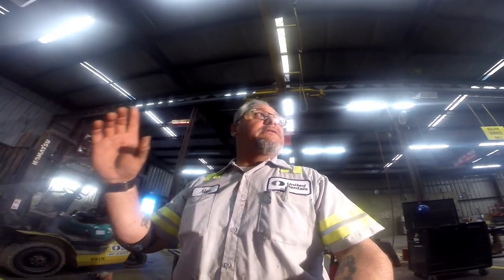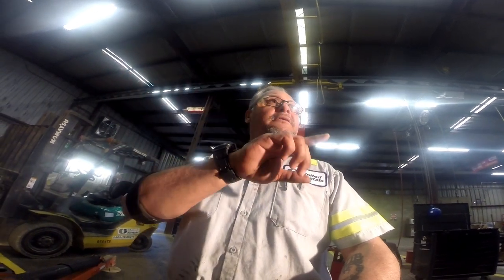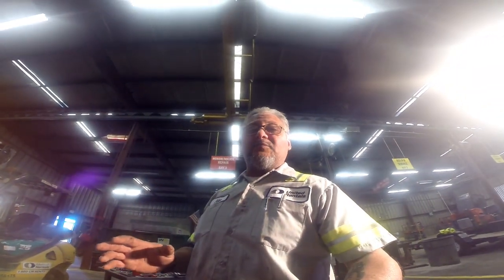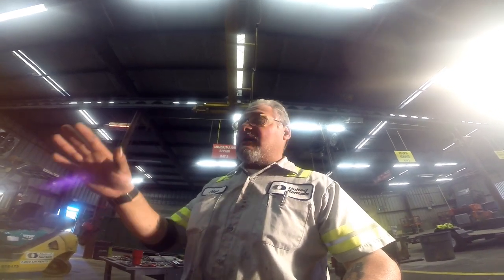Before I did all this, I made sure of the weight. I do have a 2-ton crane, say 4,000 pounds. The boom itself, with the cylinders, basket and everything, weighs about 2,300 pounds max. So I was pretty good, and it actually came off very easily, very balanced, and remember how I had it strapped down and everything, so it was safe. So stick around and we shall continue.